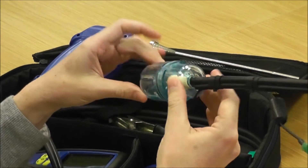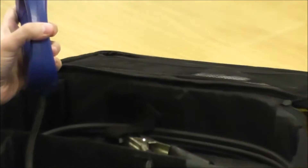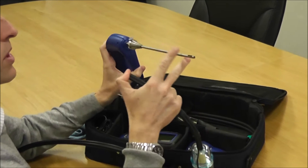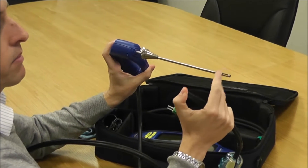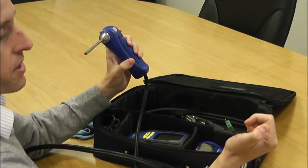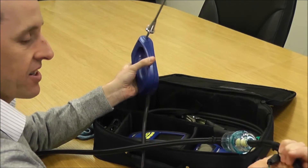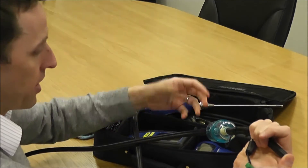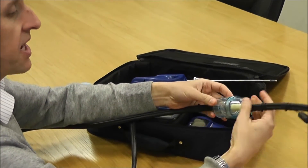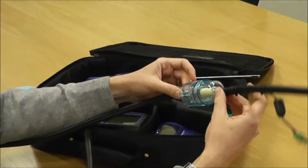The way to check the integrity of your flue probe: put your thumb over the probe end, put your mouth over the other end ensuring you cover the thermocouple area for an airtight seal, and then blow as hard as you can. If you can't pass air through, it's airtight — no leaks. If you can push air through, investigate further to find where the leak is, and if need be — this is typically where leaks occur — replace the whole filter assembly and water trap.